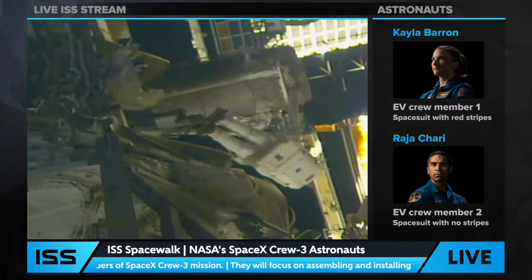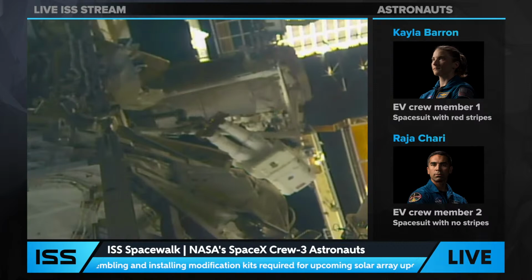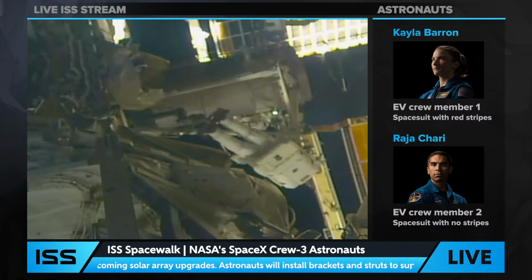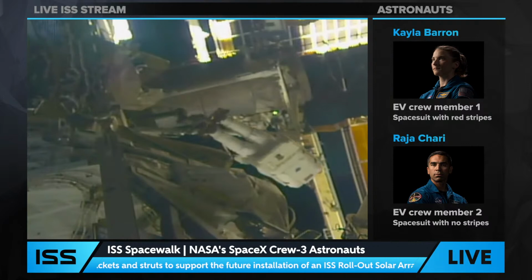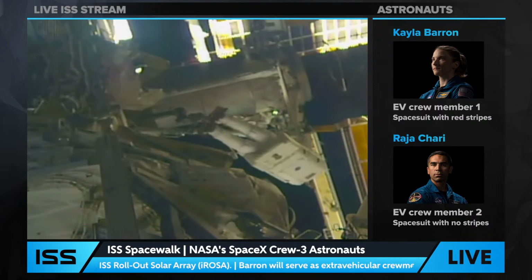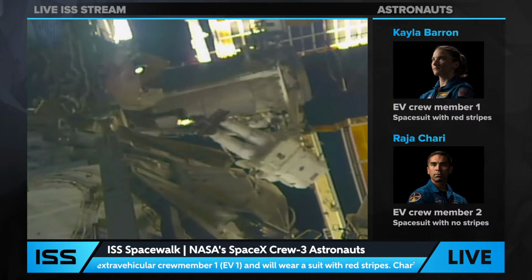I had a low torque, so I can hit it again. Looks flush, black line. Copy. You can hit it again, 4.5 for a total of 6.5 with a low torque. Go hit it again. Good green light, maybe a quarter turn, 12.0, like 0.4 turns, what the PGT says. Good green light, and I heard you earlier say the black line is flush. All right, it's a good M24, you can stow your PGT.